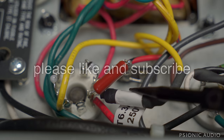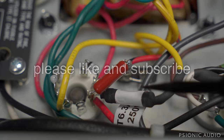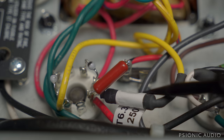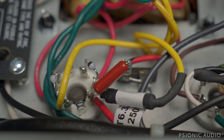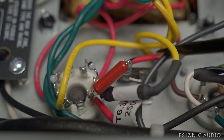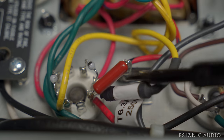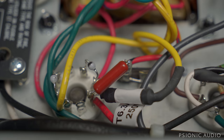In the previous video I was trying to describe things but the camera was between me and the piece so I could not really see what I was seeing. I identified this inline fuse holder as being on the HT coming off of pin 8 going to the filter caps, but in reality it's on the 5-volt secondary for the rectifier tube.